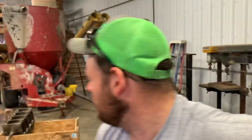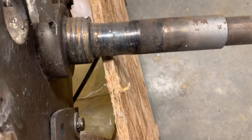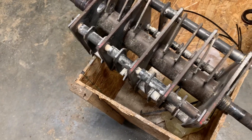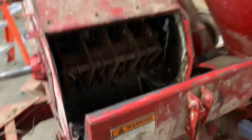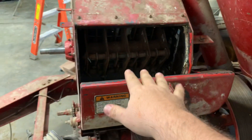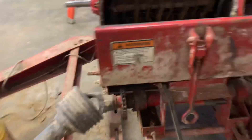Here's a little grinder mixer update. Most of the parts on this thing are discontinued, as I mentioned in the last video. We got it pulled out — shaft was bent, hammers pretty well wore out, they've been flipped all except one turn. My uncle found a whole hammer online out of a salvage unit, a 358. Apparently this model 355 is one of the later last models, so some parts from different grinders will fit this one, but some of these parts won't fit on older ones. Luckily, the knives on the salvage unit have only been flipped once, so it's less worn out.